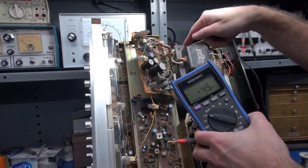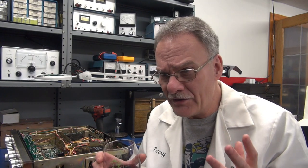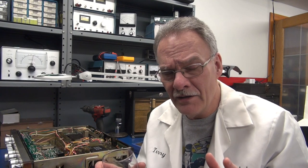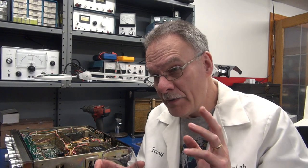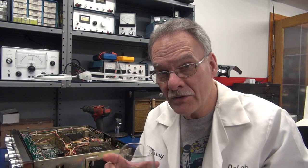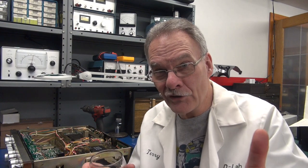Obviously not all the problems are on the power supply board. So far our results are illogical — that's because I don't have enough information yet to tell you what's wrong with the Pioneer. My guess: somebody's been inside that relay and may have physically damaged the coil. There may be a power supply issue, or there could be one of the output channels that has drifted bias-wise. I'm not going to know until I investigate this further. In the meantime, you've got to wait for the next Solid State Cinema.